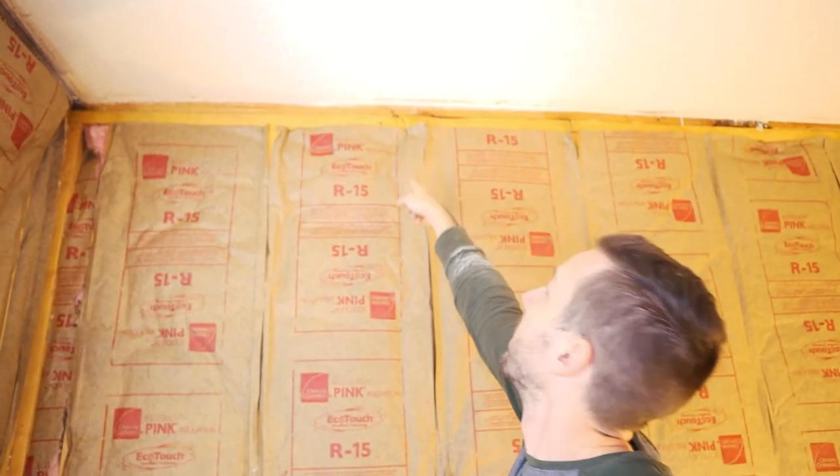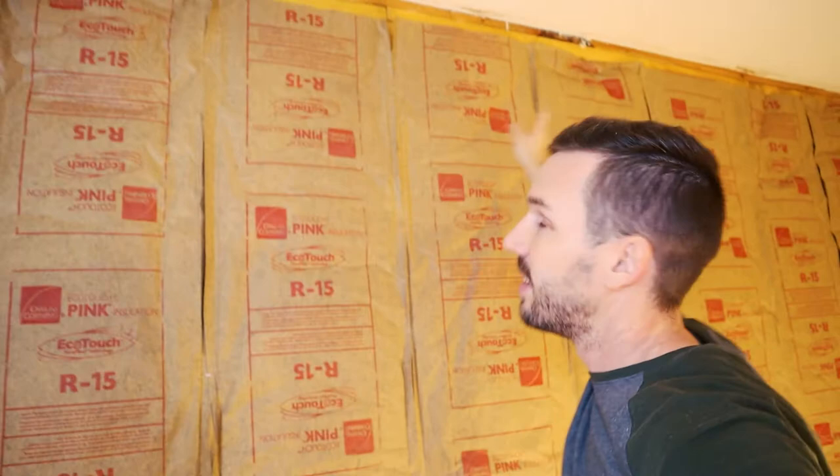When you do a big patch, it fans out the patch so you'll never know it was there — that's really the only way to do this in an existing ceiling with no attic space. The other alternative is getting an extension drill bit — a really long bit — and they call that blind drilling. If you have pipes, other wires, or things like that, it can be a huge mess and very dangerous, so I don't recommend it. This sheetrock method is a lot easier, especially if you're not scared of sheetrock work. Luckily for me, I'm going to drill through my sill and then through my studs. That's another option — come through your walls if you feel more comfortable sheetrocking a wall than a ceiling.